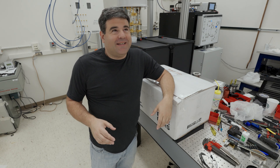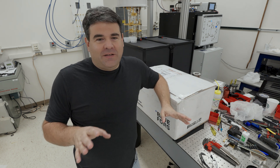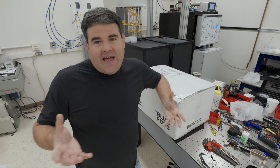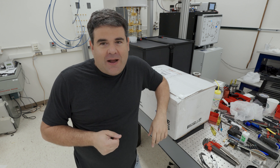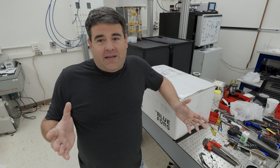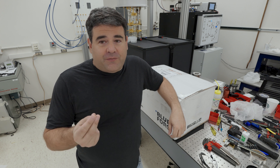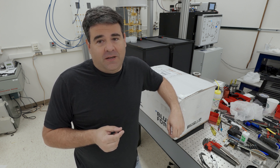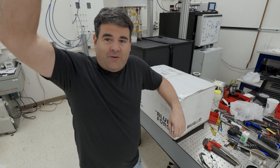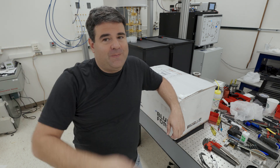Why can't it ever be easy? Whenever we have something go wrong in the lab, it's almost always more complicated than you think. Simple problems you fix immediately. The hard problems are when there's multiple things happening at the same time that often cancel each other out and make your life miserable. So that's what's happening here. What I thought was the front window leaking actually has nothing to do with the front window. The dilution unit of the fridge actually developed what's called a superfluid helium leak. So helium-4 becomes a superfluid, which means it can creep up walls without friction and it can find tiny little holes too small for gas to go through and get through.